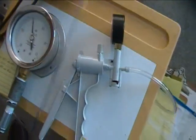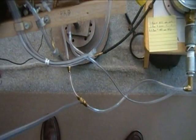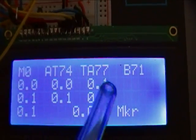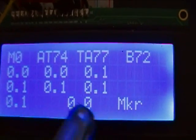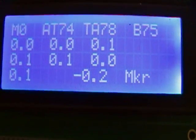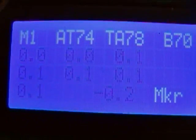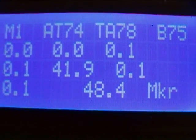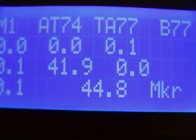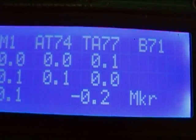The last thing I want to show is working with the higher pressure sensors. The high-pressure sensors are hooked to the one-bar gauge piped together — they are number five and number eight. All I'll do is suck on these and you can watch. I'm going to suck hard enough to get the reading up to about 40 inches of water. Once the pressure stabilizes, you can see they read pretty darn close to each other.